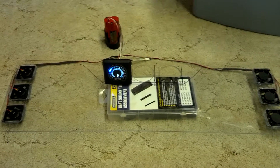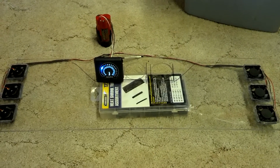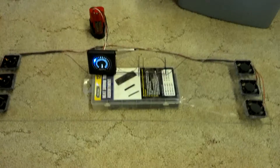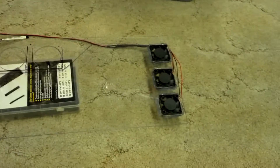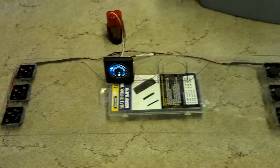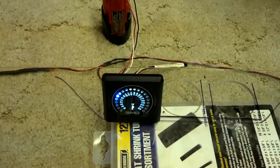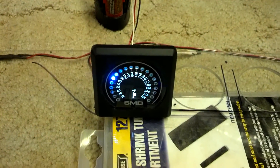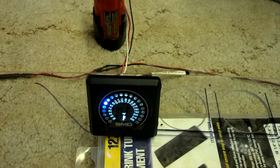Doing a little product demo of this SMD TM1. Right now I'm making a faceplate for a DC 5K. I've got these 40mm fans, three pulling in and three pushing out just to move some airflow through the amp. Right now I've got this just rigged up to test out the fans — it should kick on at about 100 degrees for the first stage, and then every 10 degrees it'll get 30% more power to the fans.